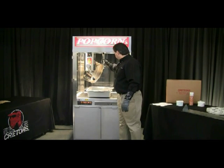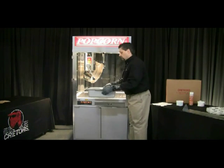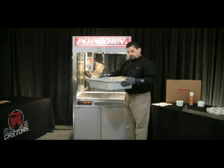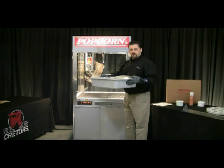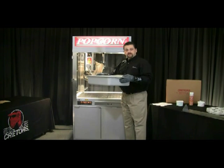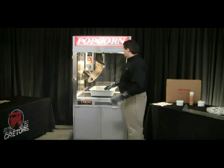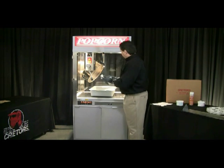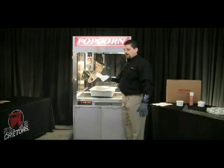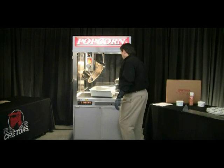Make sure that area is clean. At that point you can take your tub with all your parts to the sink, use that cleaning solution to clean up those parts, rinse everything off thoroughly, and then bring it back and reinstall it in the pan. Before we start installing everything, take a damp rag and wipe out the inside of the pan to get some of the residual cleaning product out of there.